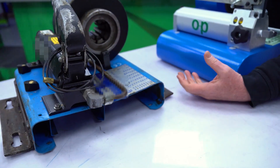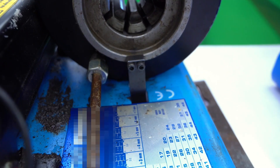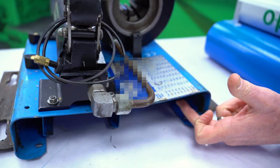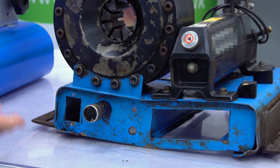All the forces when you crimp are acting down the centre of the machine. You can see what happens there — it's buckled. By buckling, you've now compromised the alignment of the head and the travel of the head. Also underneath the machine is the vernier micrometer, which is now misaligned, giving you false readings.